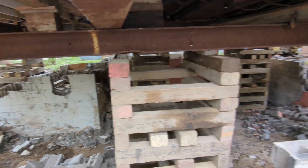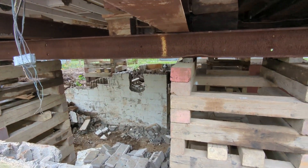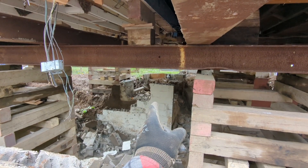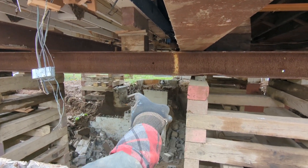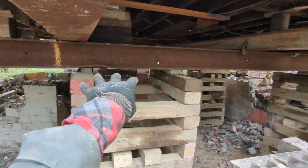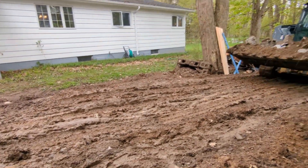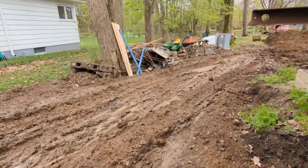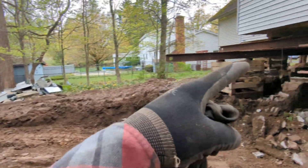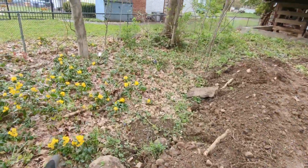Then you at least have the original footprint of the house with that much more ceiling, that much nicer, without having to make accommodations for all the utilities and systems. I think at least the sink and the sump crock will be over there. Sump crock will be in that corner because if it runs and it pumps out, it can come out and go down into that low-lying area over there — the best place for it. You don't have anywhere else here — you've got the garage on one side, the front approach and driveway on another. On our side they want a nice finished garden area and grotto, so you don't want the sump pump dumping water over there.